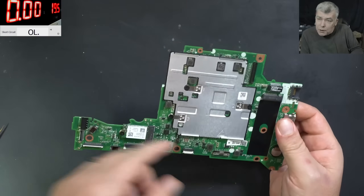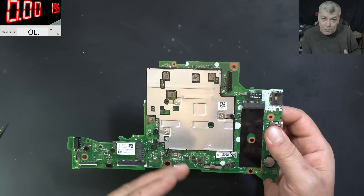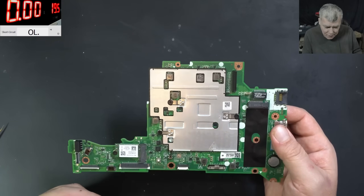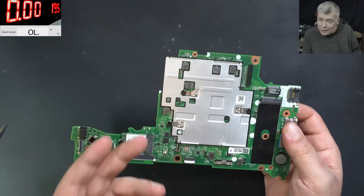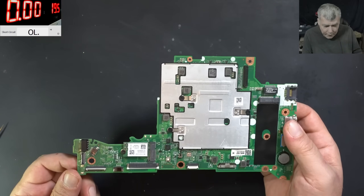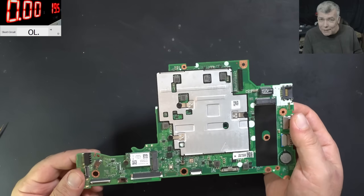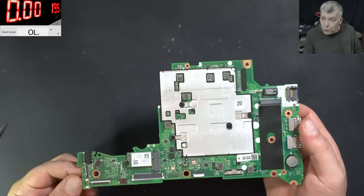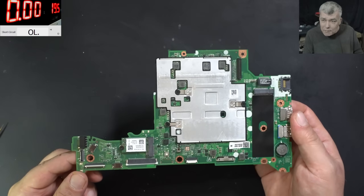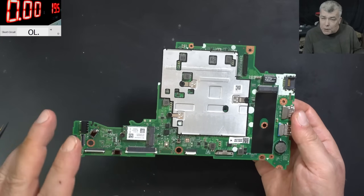Because the main power rail — all power supplies are connected to the main power rail. Any chip you take from the main power rail, check the specification — that chip is working up to 40 volts, probably around 40 to 50 volts. So the laptop is not really limited to 19 volts. So anything that happens with the voltage at the input: the diode will get shorted, and you will think the diode protected the laptop — no, the laptop is dead. The customer just came with the laptop for repair, but usually they don't repair cheap laptops. The customer will throw it in the bin and buy another one. So the diode meant to protect the laptop is actually making the laptop dead. I'm pretty sure if the diode wasn't there, the laptop would still be working today.